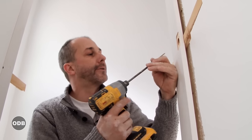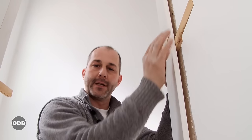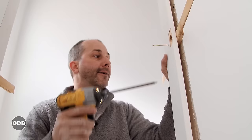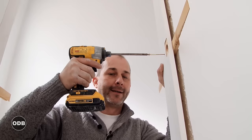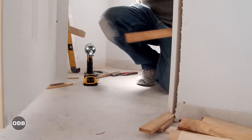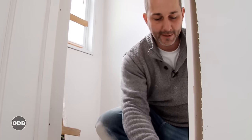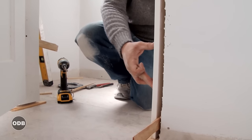Important to note when putting in your screw: when adding shims to set the thickness, you want it to be just a little bit tighter than the last spot you worked on, because when you put the screw in it will compress those shims and it'll actually be a bigger gap than you thought — by about a thirty-second of an inch. If you like to make things perfect, that's important. Also, this framing is a little twisted at the bottom, so we're going to put both shims coming from the same direction so the door jamb doesn't get twisted. Nice and square.